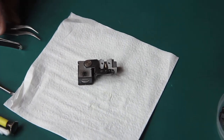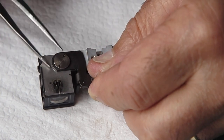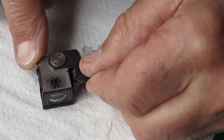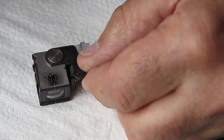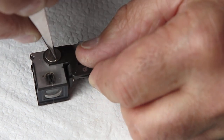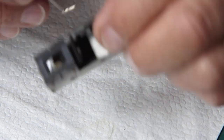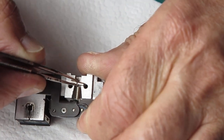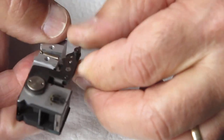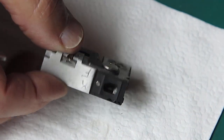Back down to ground level — check that the arm moves freely. I haven't got that tightened yet; I'm watching my alignment mark at the end that I scratched on there before I took it apart. That should be just visible and no more — it's about there. I was able to loosen this using a pair of stiff tweezers and I'll tighten it the same way. Check that that moves freely — it appears to. I've got my return spring which fits in here; I'm stretching that spring out and dropping that pin in position at the back. Check that it moves back freely — that's good.